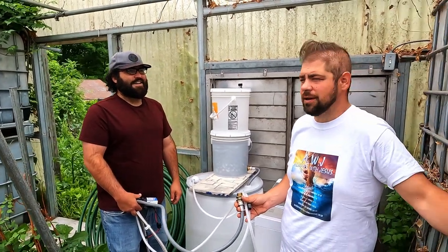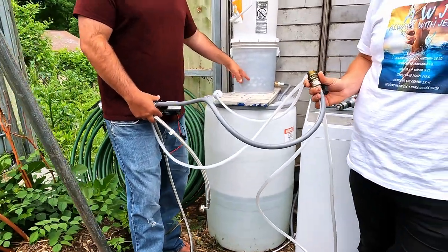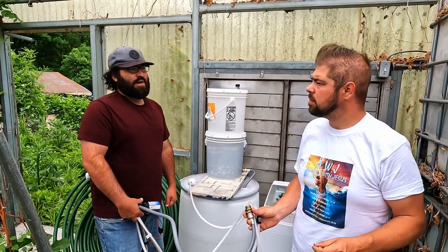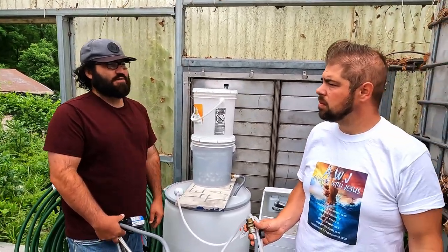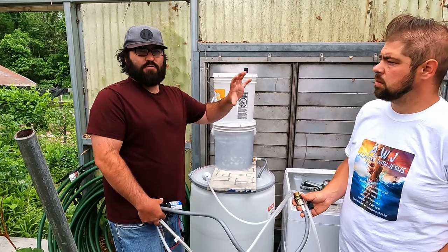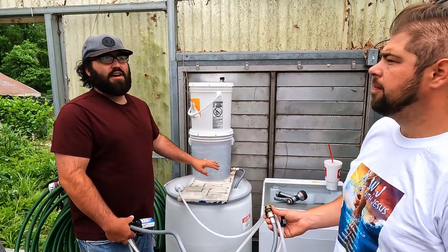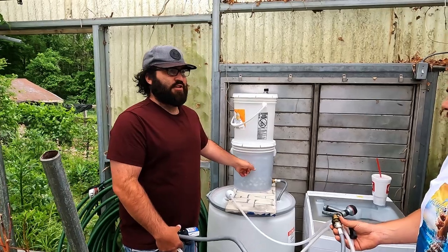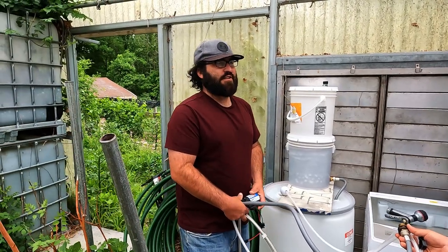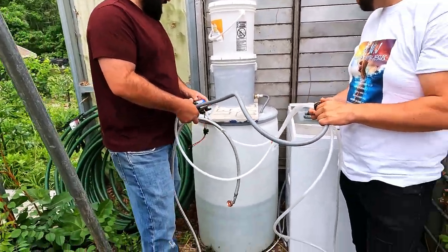This is a temporary rough filter — phase one. This will get it down to about 20 to 50 parts per million of total dissolved solids. We want to get down to like two, and that's where the biochar and the fine sand and the multi-stage filtration comes into play. Also, this is going to plug up a lot faster than a four-stage setup, because the rough big rock catches a lot more. Right now it's going directly onto the fine sand, so it slowed down a lot quicker and it's not going to last as long. The ref changes out every thousand gallons, where some of the big filters people put on little houses have gone for five years — they just skim off the top or change the charcoal out every now and then.